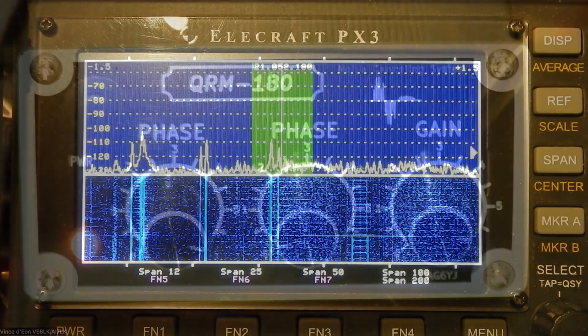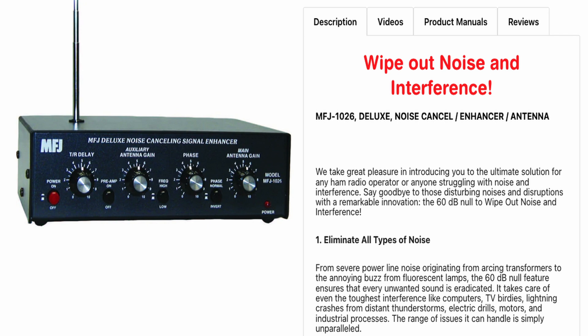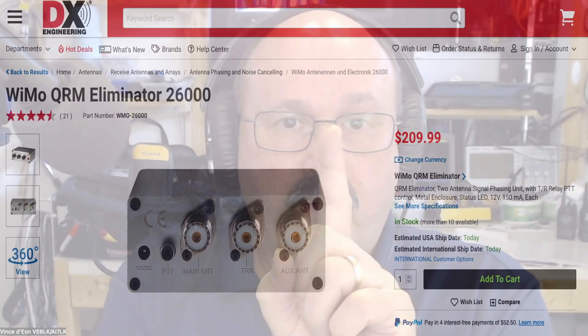That's not bad at all, and you saw how long that took me — it's not like I rehearsed it or anything. It seems to be kind of different every time. I hope you found this interesting and maybe an interesting accessory for your shack. They're sold under a variety of names, as you see here in the screen grabs, and I'll paste a few links down below in the description. What this thing doesn't do is get rid of broadband noise — it doesn't get rid of hash and static. It's designed to get rid of a single frequency problem when you're trying to work somebody on a particular frequency. It helps get rid of that adjacent noise. This is just another nice tool in your toolkit to have around in your shack. I never need one of these in the field — there's never a whole lot of noise in the field. That's me running on battery in QRP. I hope you found this interesting. Thanks for watching. 73, see you soon.